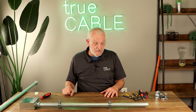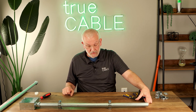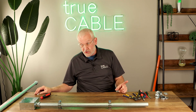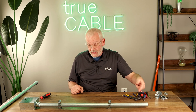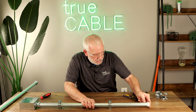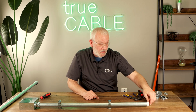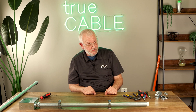In low voltage, we often have conduit that doesn't terminate in a box and the wire just comes out next to a wireless access point, for example. When you have a situation like that, you still have to be wary of the sharp edge and protect your data cable. That takes a special kind of bushing — pop that bushing onto the end and it's protected inside and outside. Your cable jacket will be safe.